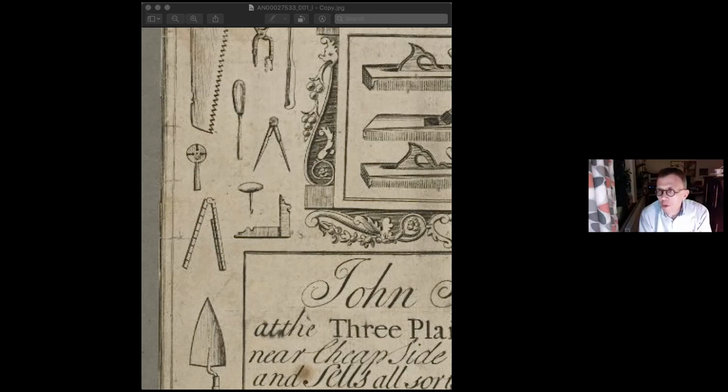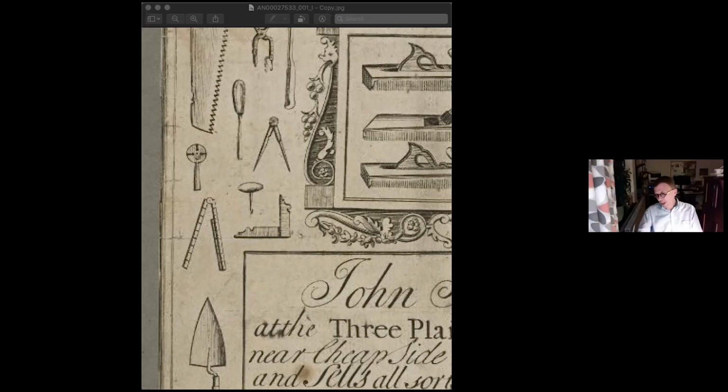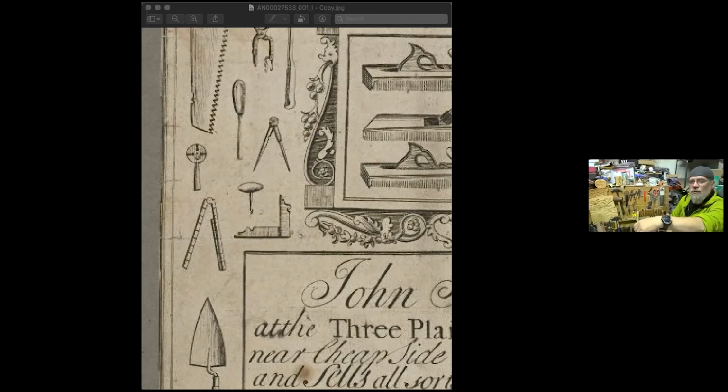And it allows you to get proportions. So you set your dividers to measure the width of something, and you set that on the 12 spot, and you can then take another pair of dividers and put them in the 4 spot, and you will get a third of the original measurement. Right, okay, so for scaling.